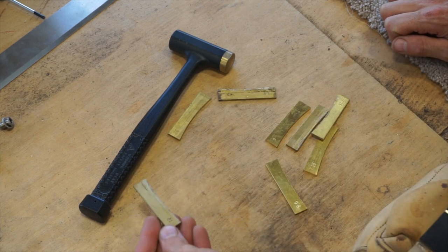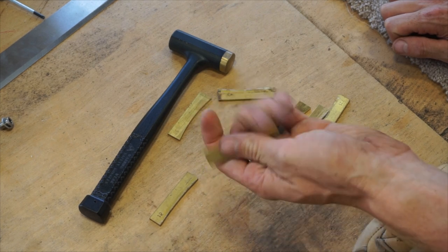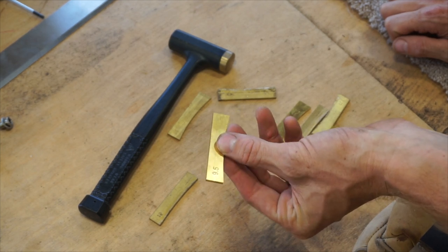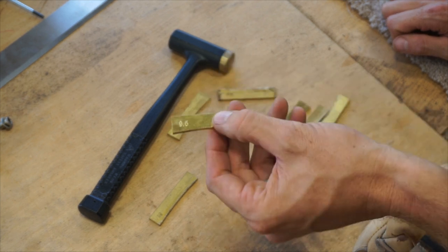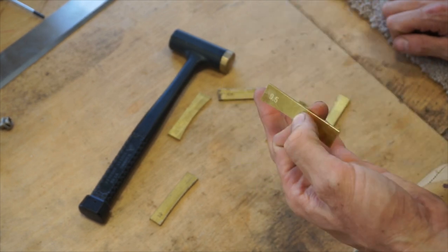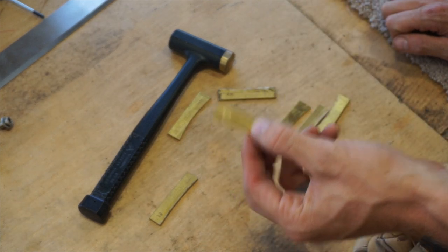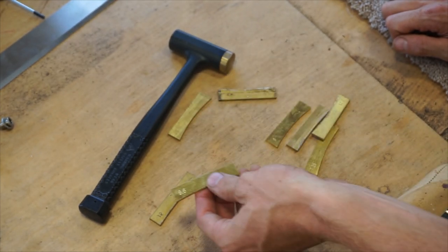But because I want to really target those fret ends, I'm actually going to use a fret press insert that is a little bit more radiused so it can specifically target the fret ends. Because when you hammer in fret wire, the middle of the fret wire always goes in really easy. That's not the area you have to worry about unless you didn't clean your fret slots or prep them appropriately. It's always those pesky fret ends, and one thing you can do about that is just press them in